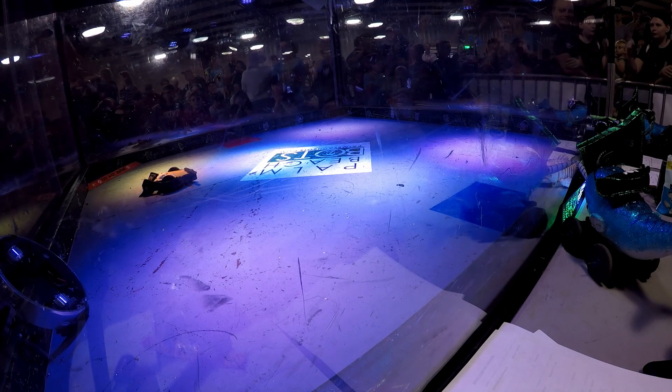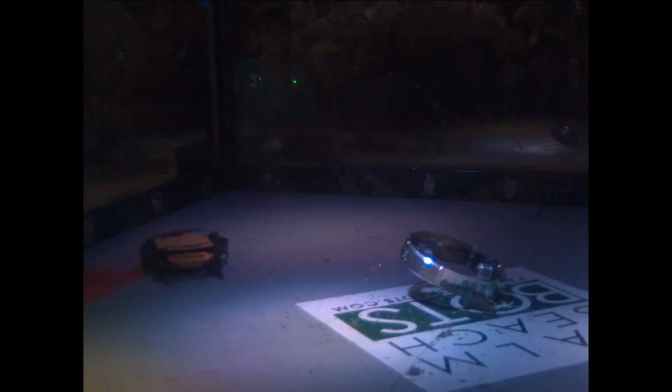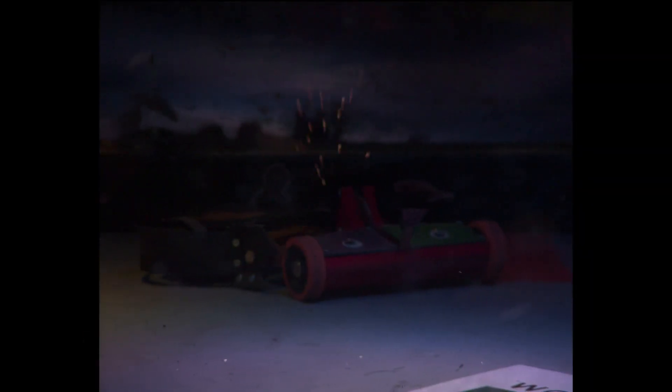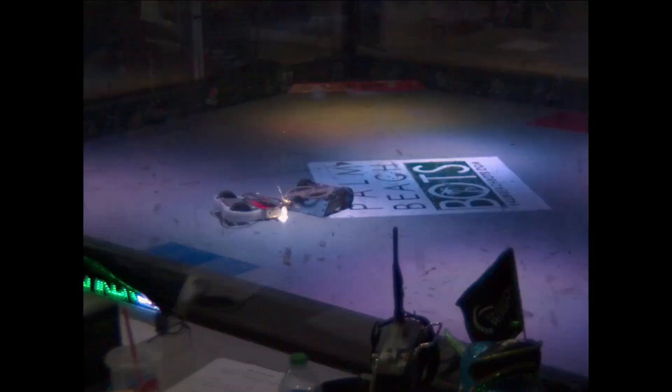The Loctite holding the dead shaft on the replaced motor failed. When the shaft twisted out, it pulled the motor wires until they busted the insulation and shorted to the chassis. From there all hell broke loose and every digital device in Halo had died a fiery death. So overall, the event was a bit of a dud. Hit-and-Spin got some unlucky damage and Halo had more fundamental issues. Moving forward, we're going to continue working on the new sensor solution because it's clear infrared has got to go. We've also decided to retire aluminum as a ring material — it's too prone to warping and difficult to manufacture. And we've got a new 30-pound robot coming down the pipe that we hope to debut at Norwalk Havoc this year. Thanks for watching.